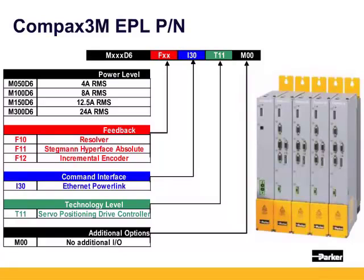Units are addressed with the DIP switch bank. The amplifiers come with a cable that daisy-chains the units together on top, allowing the user to connect via USB to the power supply unit and configure all the amplifiers and save their configuration in one file with the C3 Parker Integrated Engineering Tool software. The PIET software allows users to add multiple amplifiers into each project file, but then each amplifier is configured with the C3 Servo Manager software, which is encapsulated in the PIET. So each amp is set up the same as the C3S, except the PIET allows one file for the entire machine.